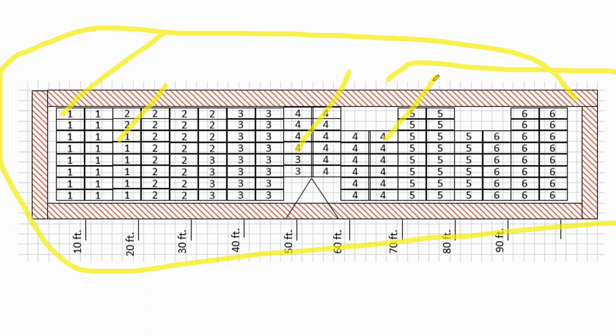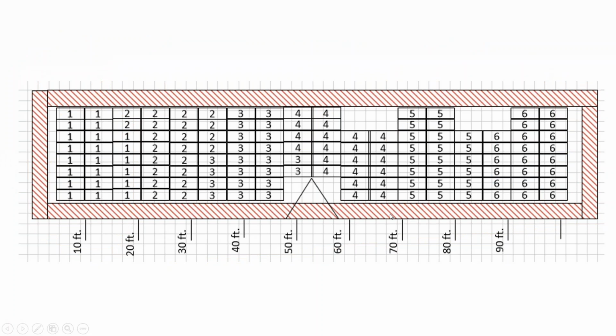you can't see where the circuits start and stop once the array's installed. And so, obviously, project documentation can help that, but are we going to document every single thing that we do always? Maybe you should in this particular case, but what an electrician would say is, you want to have your circuit layouts be as straightforward and logical as you can, and there's really no reason on a solar array, if you're landing your circuits at the edges, for any solar installer not to be able to get up and service the array. And so I've actually kind of backed down on going for fewer circuits. And if it means that I have to install one or two more circuits to achieve a logical and straightforward circuit layout, then that is what I would recommend.